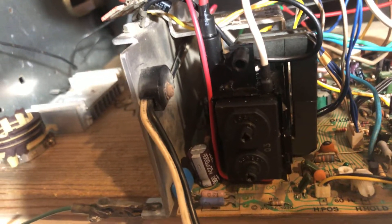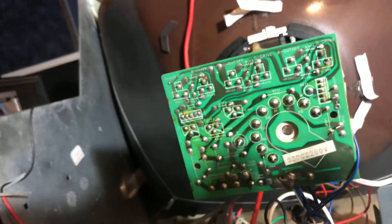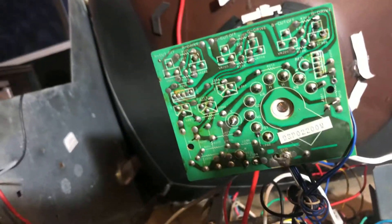It hasn't moved, and it hasn't changed brightness or focus since I had it on — it's been on for quite a while. Typically a brightness and focus problem is a flyback, which I diagnose as either the flyback or something wrong with the socket on the neckboard. Those are usually the two main culprits.